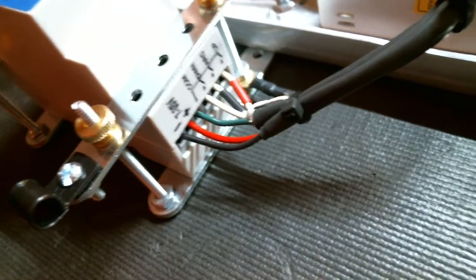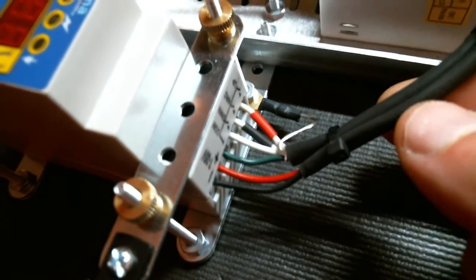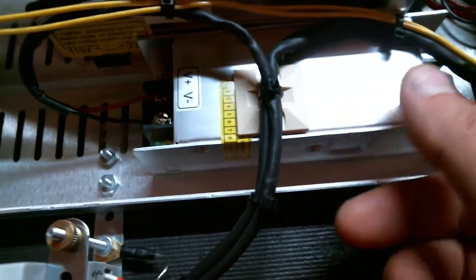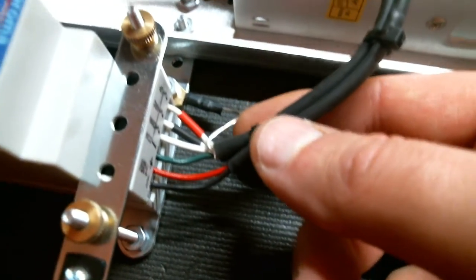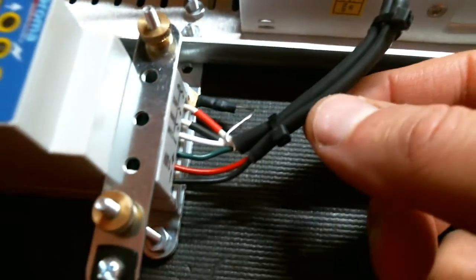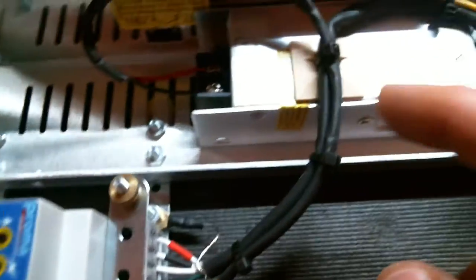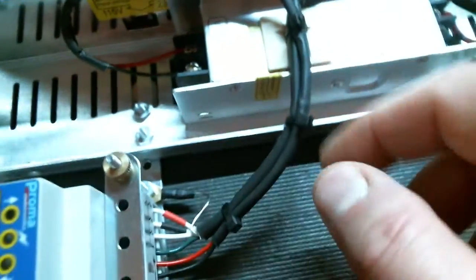The wiring on this is very basic. These cables are custom-made by me using military-grade heat shrink with integrated shielding — the shielding inside this heat shrink is a metal film that is conductive, and it is earth-grounded right to the base, so everything is done properly and the power is also shielded. Everything you see with this black sheathing is actually shielded heat shrink, so that the signals coming from your G540 are now shielded going into your PROMA.